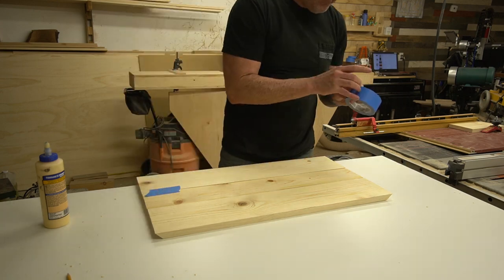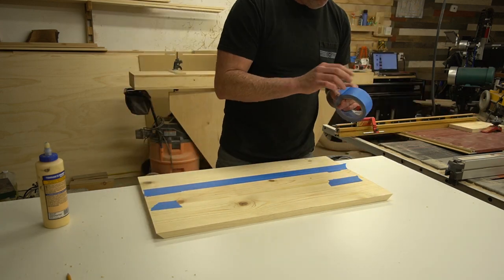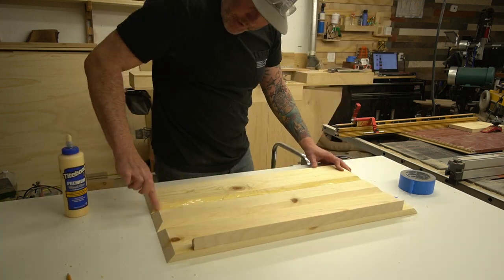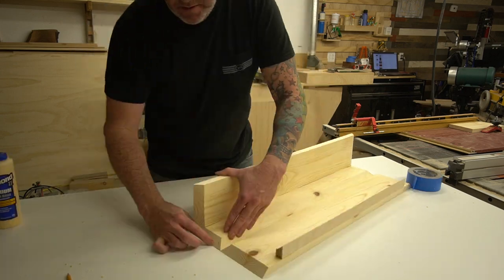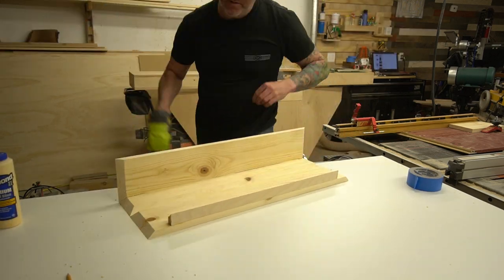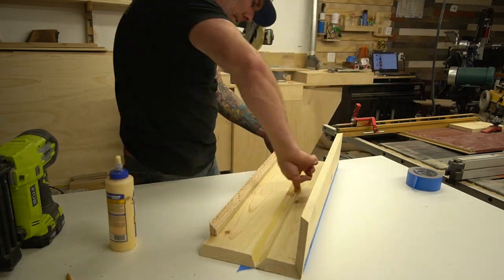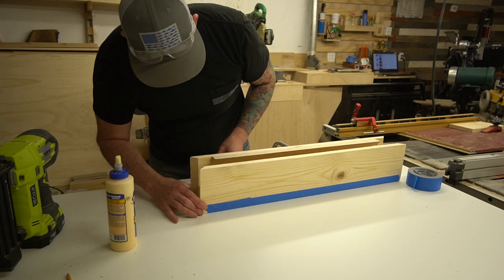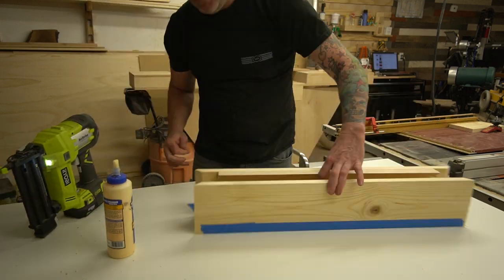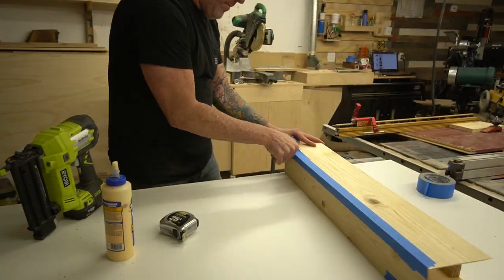When gluing up joints like this, I flip my boards over so the miter joint is facing down, get the edges flush, and use two small pieces of tape to tack them in place, then run a full strip across the length of the board. Fold it over and give it a quick test fit. Once I'm satisfied, I apply a liberal amount of glue, spread it within the seams nice and even, then fold the miter joints together and use an 18-gauge brad nailer to secure everything in place until the wood glue dries.